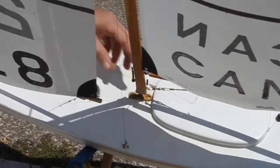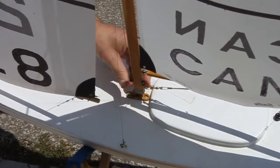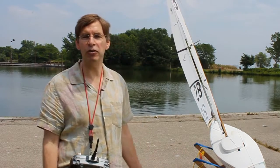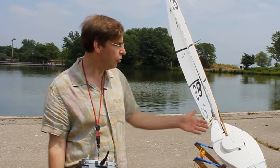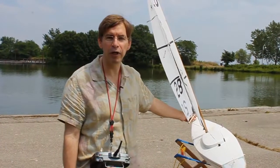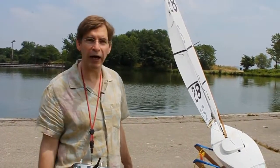The other main adjustment you need to make every time you sail is moving the mast backwards and forwards. As the wind increases, you move the mast forward. Otherwise the boat tries to round up and head into the wind by itself. If you have to fight the boat with the rudder, that's very slow — any time you use the rudder it's a big brake, you're slowing the boat down. So you'll quickly get in the habit of realizing that above about six knots of wind, you put the mast in the forward hole and the jib club in the forward eye on the boat. Lower than that wind speed, you shift them back aft.